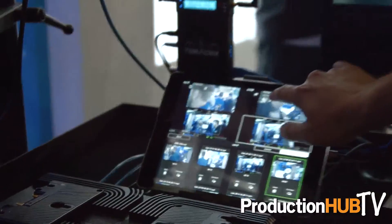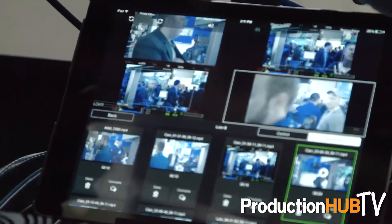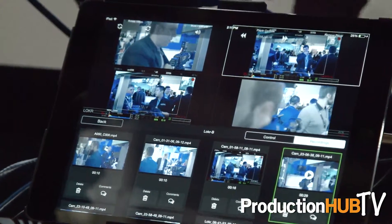Another part of the Connected Set is Locker. What Locker is doing is utilizing the USB 3.0 output of our Bolt systems, as well as HDSDI, ingesting all that zero-delay wireless feed and converting it into an H.264 signal. With the H.264 connection, you'll be able to stream the live video to up to five iPads on set. Along with that, you'll be able to create proxies and dailies that you can review on your iPad.